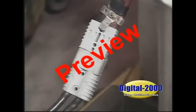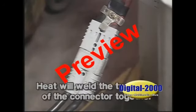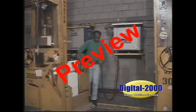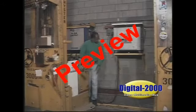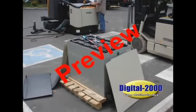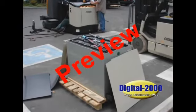If the plug is not making good contact, heat will weld the two parts of the battery connector together, making it difficult to remove and necessary to replace. Good battery terminal contact is essential not only for operation, but also for proper charging of the battery. The battery cover should be closed except when charging, then it must be left open.